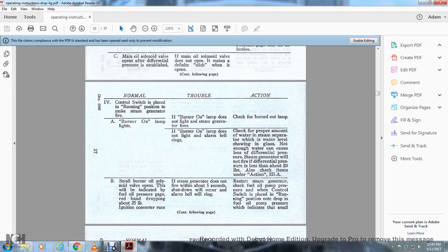Check the proper amount of water steam separator, which is the water level shown in the glass. Not enough water can cause the loss of differential pressure. Steam generator will not fire if the differential pressure is less than 20 pounds. Also check the items under action 3A. B,